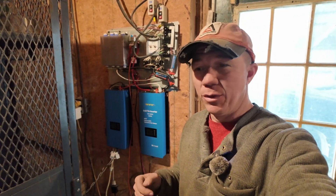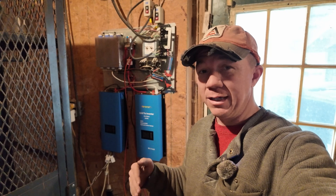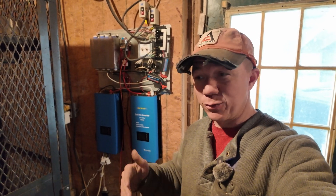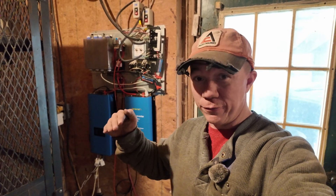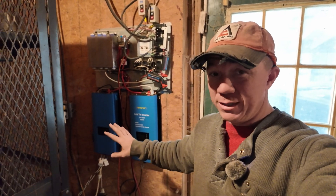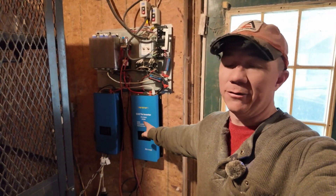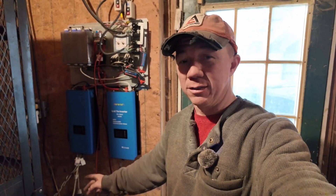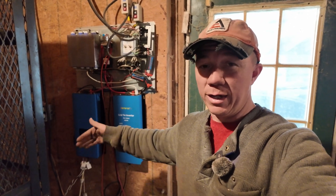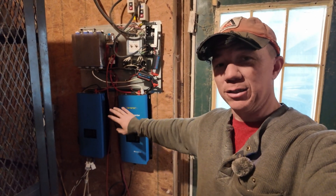Last night, for instance, we had 50-plus mph minor gusts almost all day, with peak gusts from 8 p.m. until about 2 a.m. in the upper 50s to low 60s. The problem is I have to leave the batteries on because it'll push through these and kill these inverters — and I'd have to replace the capacitors again. So it's far easier to just put it on the batteries and let it drain down. Then the next day with good wind, I'll hook up the batteries and let them charge, and once they're charged I'll disconnect them and go back to the inverters. But it is super inconvenient.